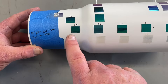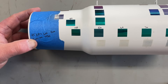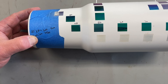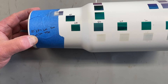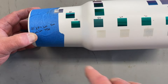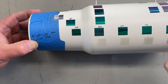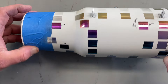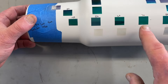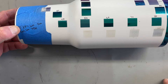One step further: we kept everything the same and ran the same power test at 40, 50, 60, 70, 80, and 90 percent — but we changed the kilohertz. Instead of altering the beam combiner, in LightBurn under the advanced settings in your cut layers, you can toggle on the kilohertz. We changed it to 25 kilohertz. What we achieved at 90 percent normally, we were now achieving at 80 and 70 percent — reducing power needed by 10 to 20 percent.